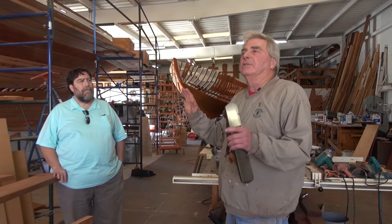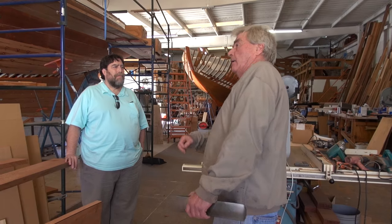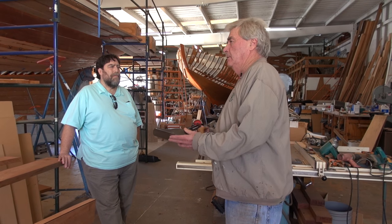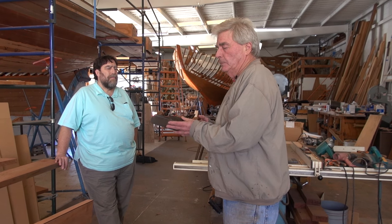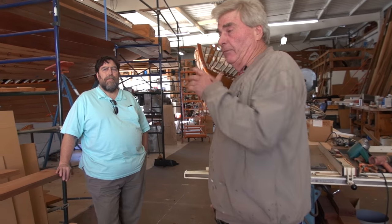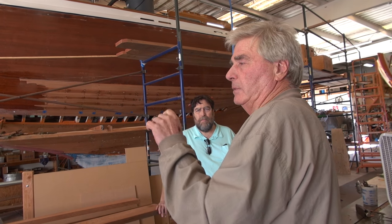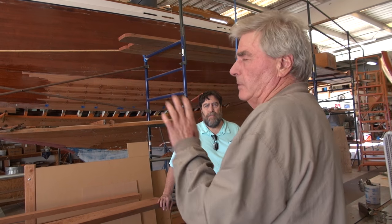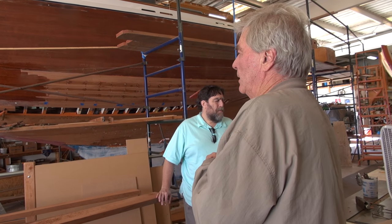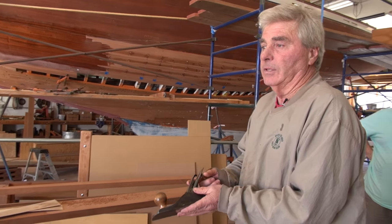Like the shutter — you want it to go in kind of easy, not bam bam. You see guys doing that and it's just oh no. And that's because you want it to have somewhere to swell to. Yeah, because if a plank can't swell, what happens? It gets wet like a sponge. If you're squeezing a sponge, it can't absorb any water. As soon as you let go, the sponge can absorb water. It's kind of like that. But the plank will crush across the fiber, across the grain, and not ever get any bigger.